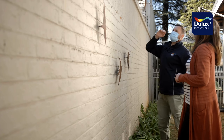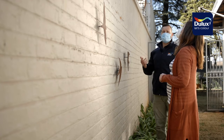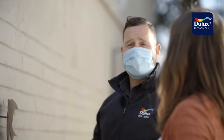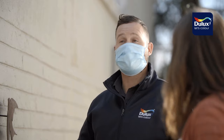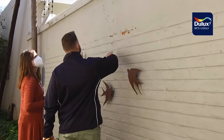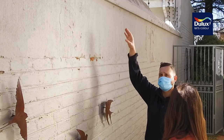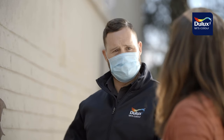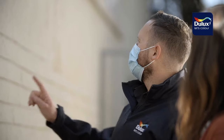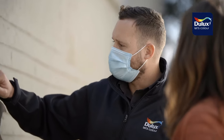On the top sections you can see there are areas that are exposed to a little bit of water. So we will need to use something like a fiber reinforced product — something that Dulux has got which is excellent for that is the Dulux Rain Shield. This will definitely prevent water from getting into your wall, which will also help to battle the effects of blistering paint.